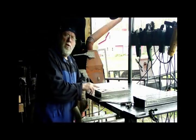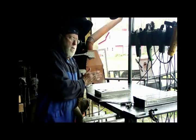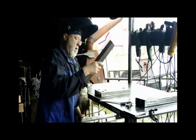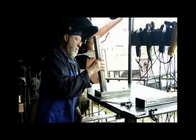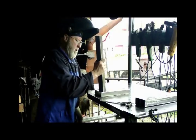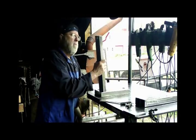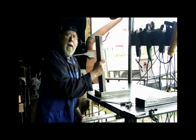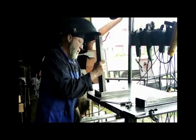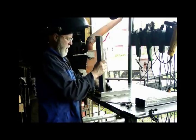The two at this end I'm going to put on a 45-degree angle, and they're cut on a 10-degree. So if I put them on a 45, it'll be leaning this way and this way, and kind of splay that leg out just right to where it's at its maximum footprint, so it doesn't tip over so easy, and yet pretty straight up and down so it doesn't bounce so bad.